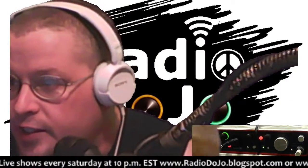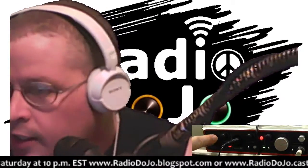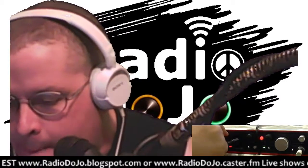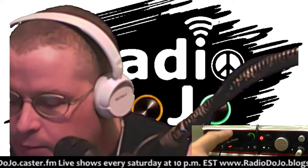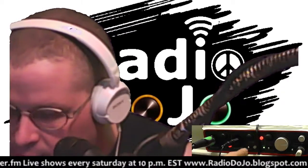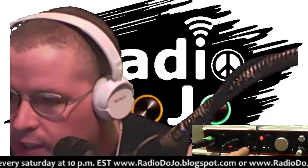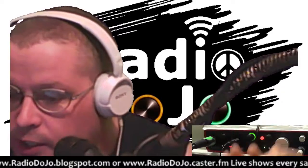So what I'm going to do is turn down — you can see right down here is my sound card — and we're going to turn down the volume on this microphone. There are a few settings I had to adjust in order to allow this microphone to work. Instead of working in line-in mode, which some microphones are able to use, it has to work in instrument mode, which basically gives more headroom for audio to come through.